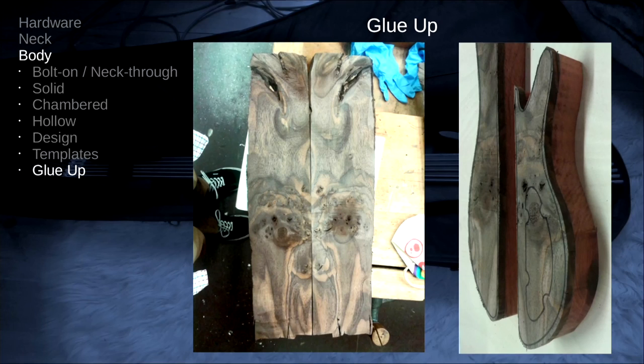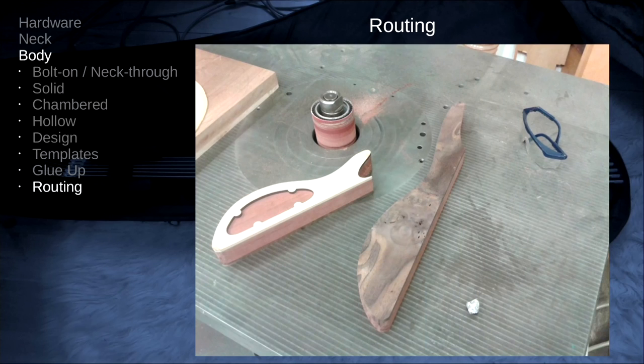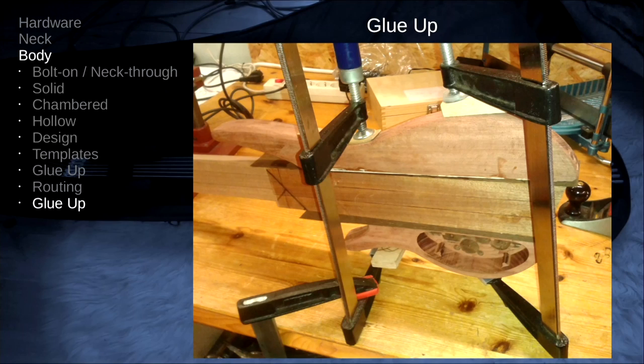First of all, I joined the Bubinga wings with the walnut burl wood and cut them out roughly. Then I tried the thing with the router and found out that I have woodworking tools and I want to work with Bubinga, and Bubinga has more characteristics of metal, and it didn't work. It just threw the workpiece all around the shop, and it was quite scary to work with. So I used a belt sander and a drum sander. That worked out quite great, but usually you want to use template routing bits with little ball bearings on top, because you can be sure that you have the design you drew up digitally transferred to a physical object. Then you glue on the wings.